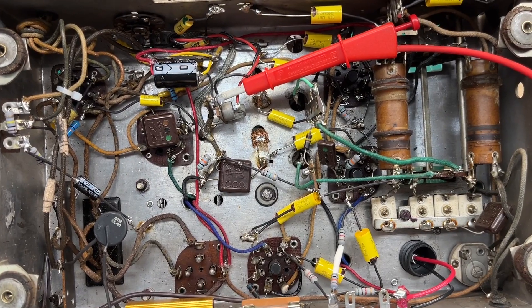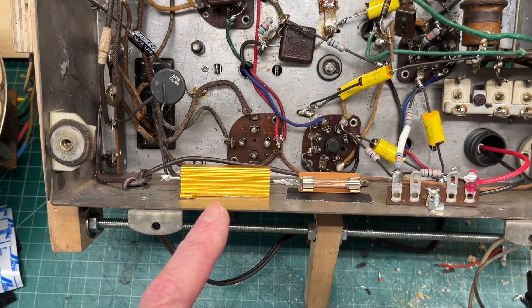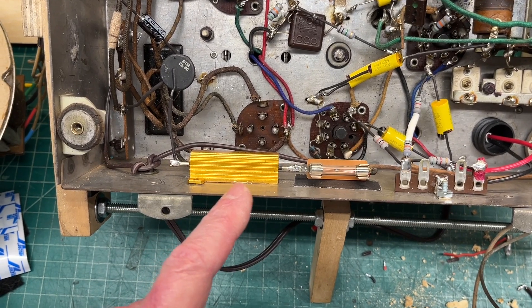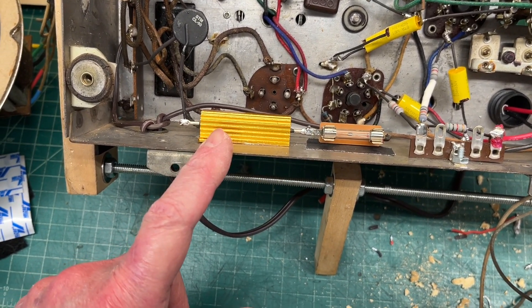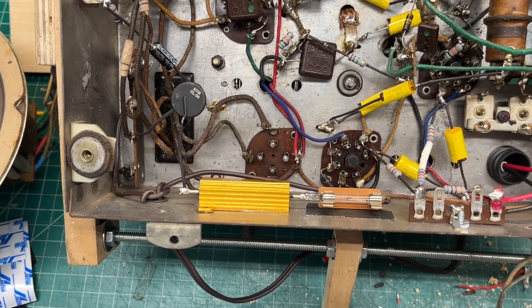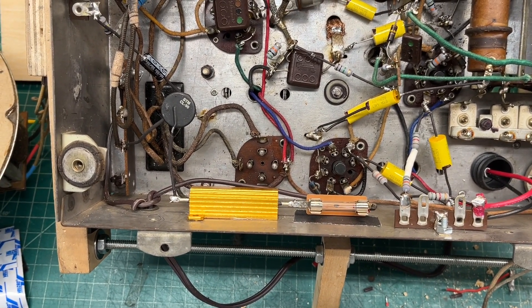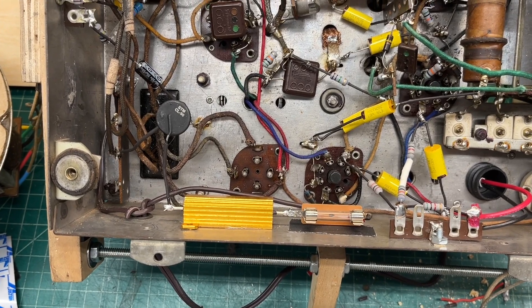Anyway, without an alignment, the old receiver here is playing pretty well. As you can see, I've got a 50-watt, 25-ohm resistor, and of course the fuse and a CL90 in here as well, just to drop the voltage a little bit and stop that inrush voltage.